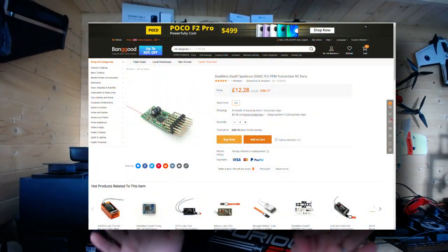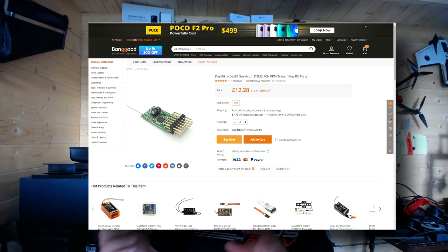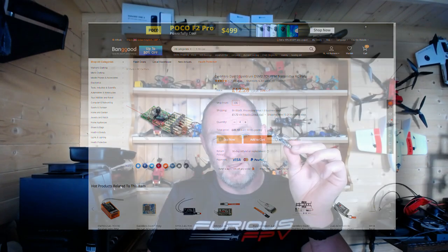I did try a different solution — I had no noise, it was spot-on and perfect. What I was doing at that point was wiring this little module into the back of a little DSM2 transmitter. If I pop up on my screen you can see you can buy these dirt-cheap DSM micro transmitter modules — it's actually a receiver which has been re-flashed with firmware to act as a transmitter module. So for 12 quid you can buy one, wire it in, and run the PPM output from the head tracker module into the PPM input on that receiver module, and off you go — you can get a wireless head tracker working over a short distance. These are designed as short-range, about 30-meter transmitter modules, and it worked perfectly with no noise.